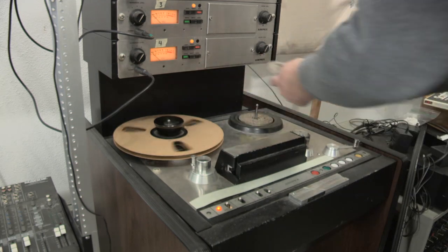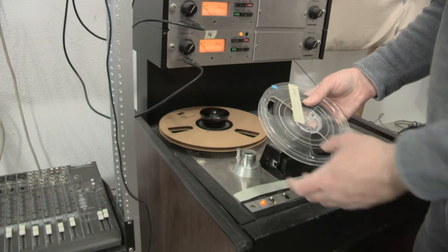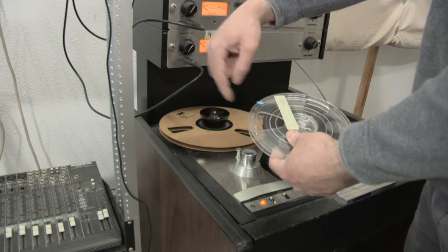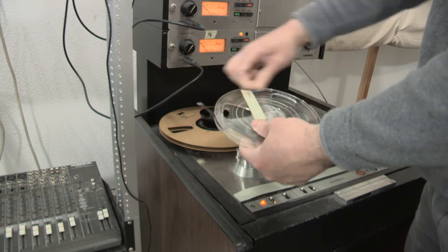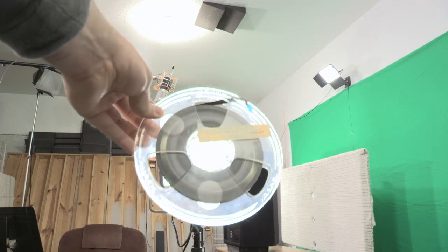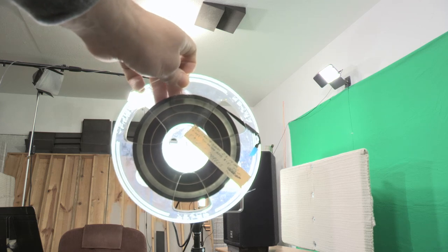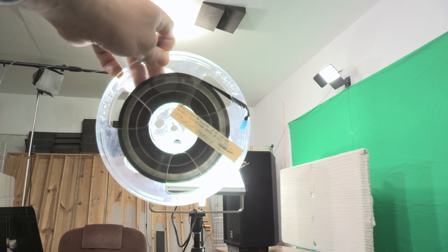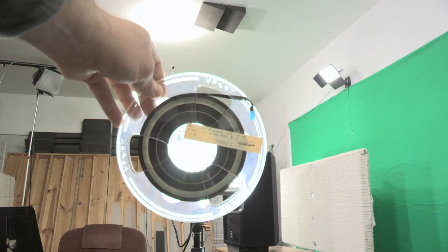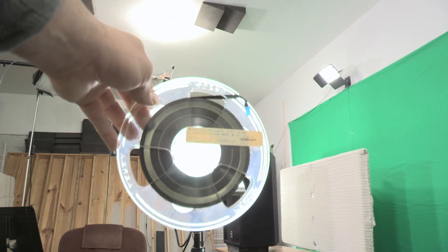My tape just ended. I'm going to secure this tag end with some splicing tape to make sure it doesn't come unwound in the box. I folded a little flag at the end of my splicing tape, overlapping the tape itself, so if somebody ever needs to use this in the future, you just grab the tag. Now, before I put this on my tape deck I examined it for damage and it looked pretty good, but notice that some of this tape is translucent — that's cellulose triacetate tape, which is a wood product — whereas the opaque portions are polyester. It's possible these were recorded at two different times, or they just had two different tape stocks handy. Considering one was at 15 ips and the other at 7.5 ips, I'm thinking these were recorded at two different times.